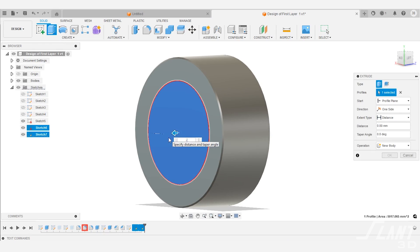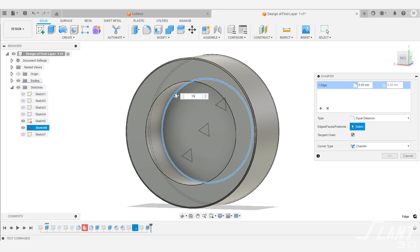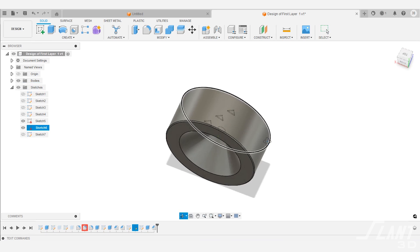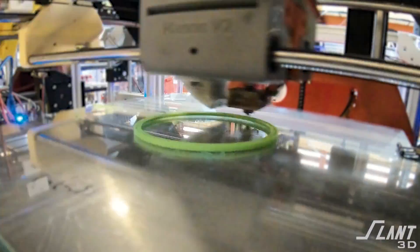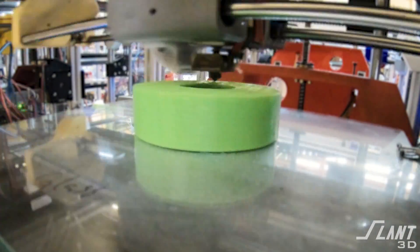In the case of the circle, you can basically cut out a cone in the bottom so that now you have just a small outer ring. That outer ring can be as wide as you need it to be. Depending on the material, you may need a certain amount of bed adhesion to make sure the part is stable and secure, but you want to minimize the contact as much as possible, because this enables auto ejection down the line — giving you a more highly automated part, which means you can make millions of them without high cost.